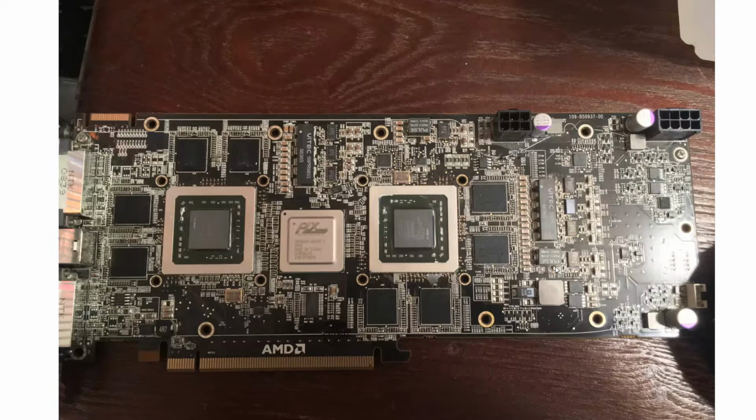Alright, so let me just plug it in here. When I was editing the BIOS, I noticed that these old cards have a BIOS message that says you do not have external power connected or something like that. They have a power warning message. So they actually take power from the PCIe slot to power up at least one of the cores, partially, enough so that it can run even without sensing power on the two plugs here. So I thought that was pretty cool.